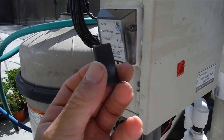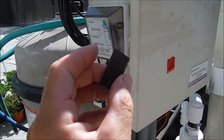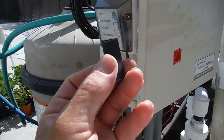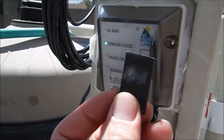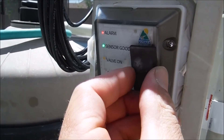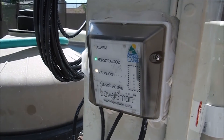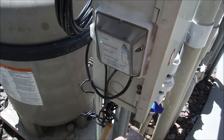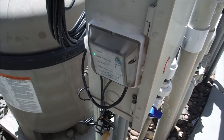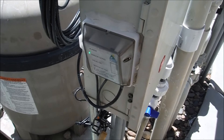You're going to need to keep the magnet. To reset your water level on the sensor or reset the whole unit, this is what the magnet is for. You can also test the valve by putting the magnet on for less than 20 seconds — it should activate. Pull it off and you'll see the valve activated. If you leave it on for more than 20 seconds, you'll reset the unit and it will search for another level sensor. So just put it on for a few seconds, pull it off, and the valve should activate.